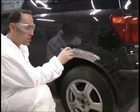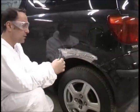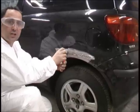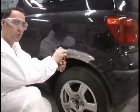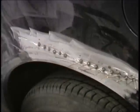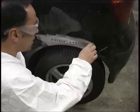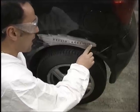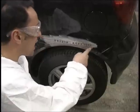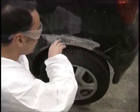What we're going to do now is just cut these pins off, and I'm using a pair of cutters. The metal on these pins is quite soft, so you can easily cut them off. Always wear safety goggles just in case. What you don't want to do is wobble them and try to get them off, because what will happen is you'll end up with a hole in the panel and then you're going to have to MIG weld it up. Best thing to do is cut them off and then grind what's left.